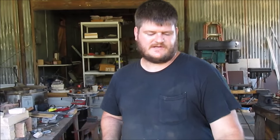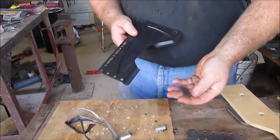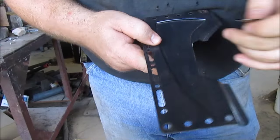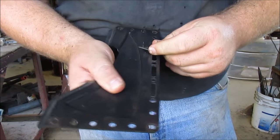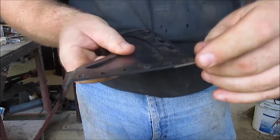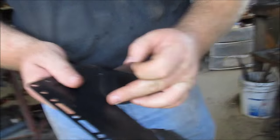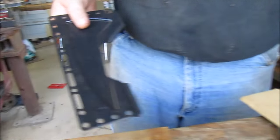When you pull it off the trim jig, there's a little bit more trimming to do with a disposable razor blade — not a whole lot, just a little bit. I'll clean up especially along the slots and make sure all the holes are cleaned well so it sits flat. Then I'll do a little bit of grinding on the inside of the corners to make it easier to unsheath.